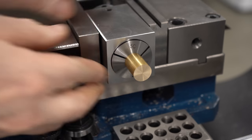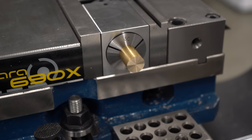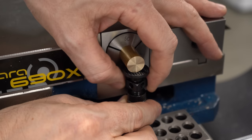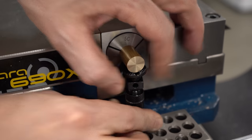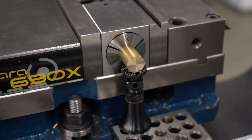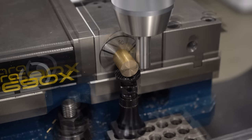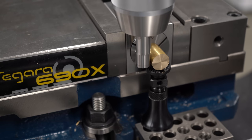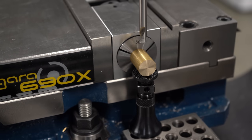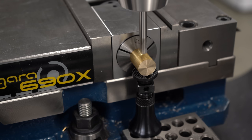I'm going to try to do as much of the milling on this part as possible in one setup in a 5C collet block. I have a stop on the vise jaw so I can take the block out and put it back in the same position just rotated 90 degrees. I'm going to bring in a machinist jack to support the part from underneath - the collet isn't gripping on very much stock because there wasn't much stock provided in the kit, and the machinist jack is cheap insurance to make sure we don't push it out of parallel when we start drilling. I'll find the front and back with an edge finder, use the half function in the DRO to establish Y zero, and establish X zero on the end of the part we faced off at the lathe.